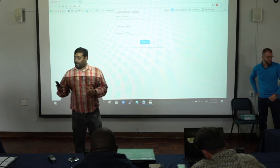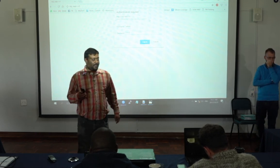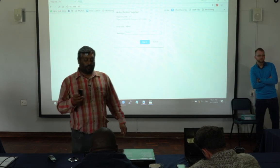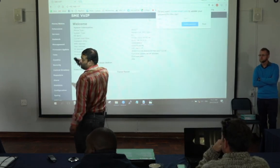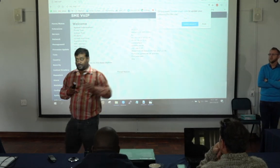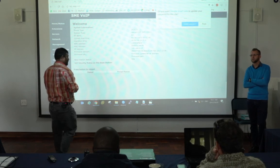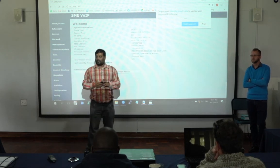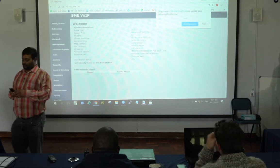Right. Okay, it's come up there. It shows me the MAC address and the IP address. In this case, 192.168.1.17. It's the IP of the base. Yes. Only the base will have an IP address. The handsets don't. And the MAC will be the MAC of the base. I mean, the phone. No, the MAC of the base. Tells me the MAC of the base. Okay.